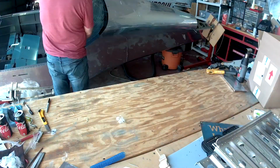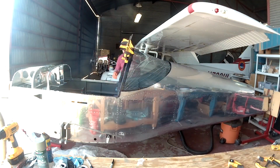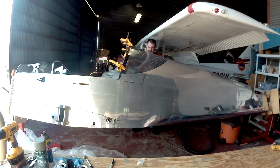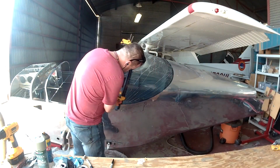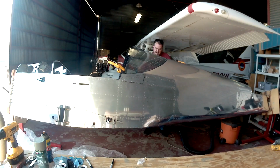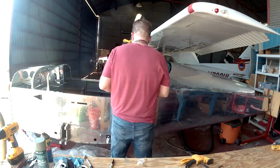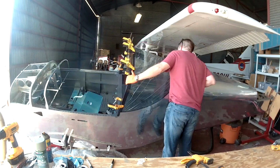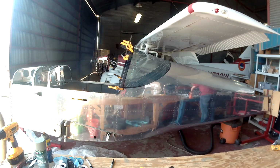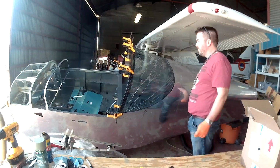So great, you do that. Once you've done that, and you've removed the protective cover, which is what you just saw me doing for a couple of minutes, because you really have to get a good fit with it off, and you've cut those grooves, all you have to do after you drill is sand the excess, because like I said, the front's not exactly square. All you've done is back the piece of acrylic up by cutting those grooves to where it's perfectly flush at the shortest place. These are really good windows. I only had to sand about 6 inches of area. That was pretty good.